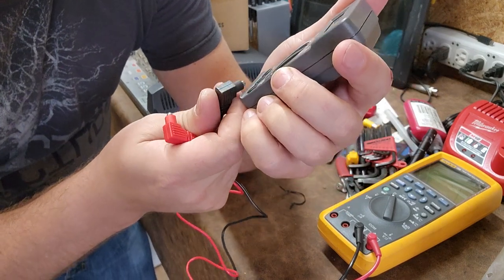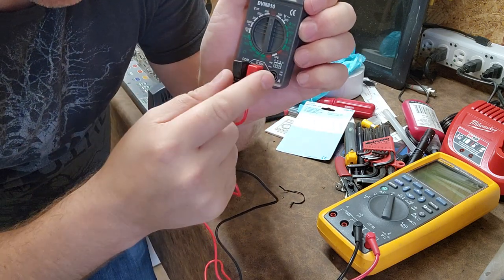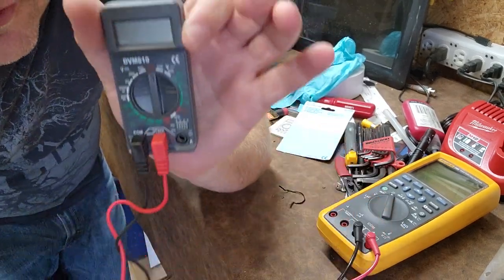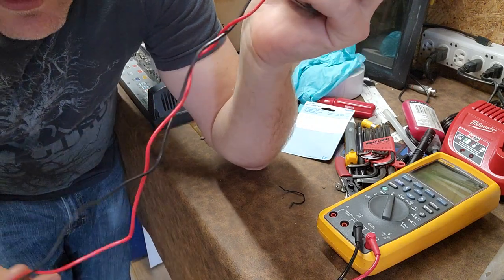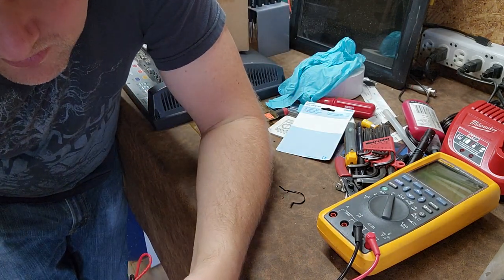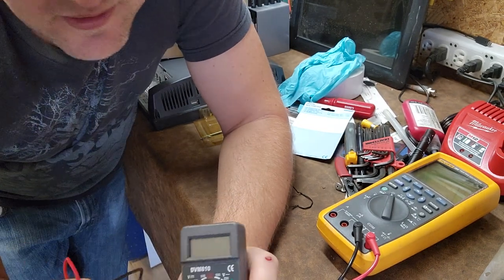Let's power this bad boy up. It's not really too well labeled — 'Common' and both probes. It's the reverse of what a traditional multimeter is: normally Common is on the right-hand side, and as you work your way to the left it goes meter and then amperage, which is usually the farthest. It says this is a 500-volt meter. I would definitely not be trusting 500 volts with these PVC-coated leads. The rating of the multimeter isn't just the isolation inside — it also has to do with the leads. It's a package.